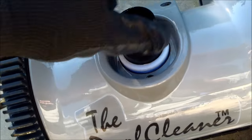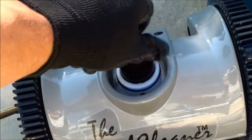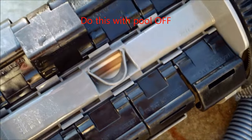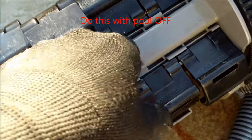You may find the cleaner coiled with hoses because the swivel is jammed with debris. If the cleaner is not moving but just twisting the hose in one spot, check the swivel and make sure it spins freely. Occasionally debris gets stuck in there — take the cleaner out and pull the debris from the front, or push it through while the cleaner is running.